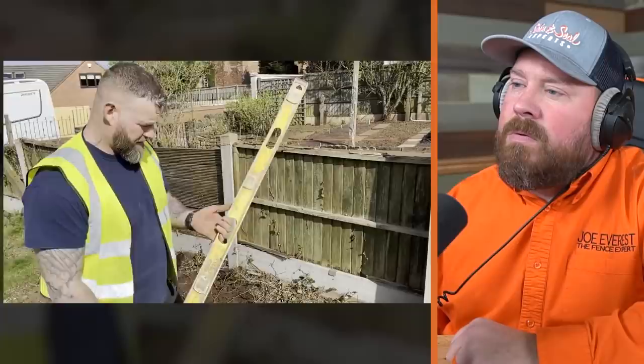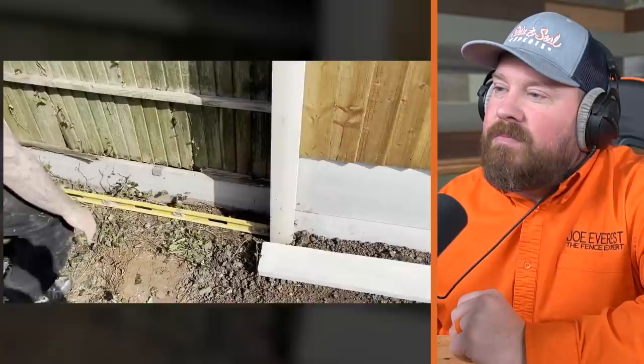It won't level anything, but it's perfect for what we need. It's six foot long, so it's the same length as a gravel board — you can use a bit of wood cut off at six foot. So the posts are spaced six feet apart, more or less on center, probably six foot three or four inches on center. When we're talking about a six-foot tall wood fence here in the States, you'd typically see post spacings that are eight foot or less. It's interesting to see that they do six foot on center — ultimately, it'll likely make for a stronger fence.